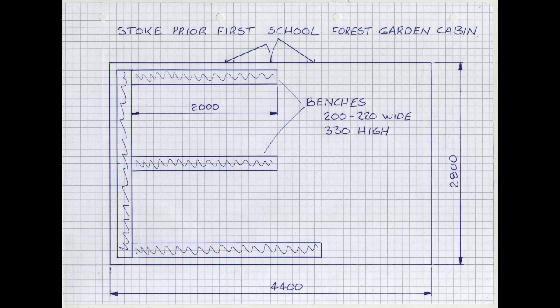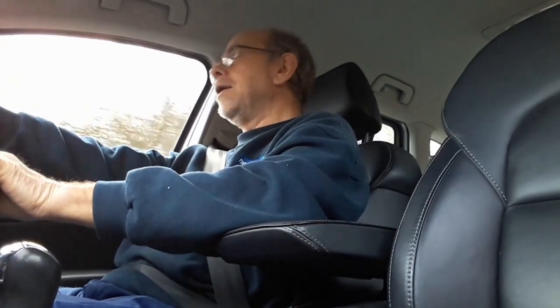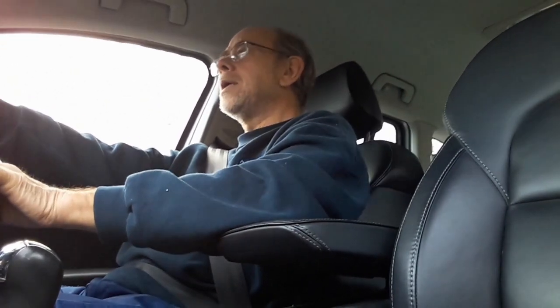When we had a look at it, the people who originally looked at it were considering decking timber. The benches need to be about 220mm wide and only about 350mm high, because they are little people. But decking boarding wasn't ideal because it tends to be up to about 170-190mm wide, and it's quite hard to find anything over 200mm wide. The other problem with decking is that it's got little ribbing on it to be anti-slip.